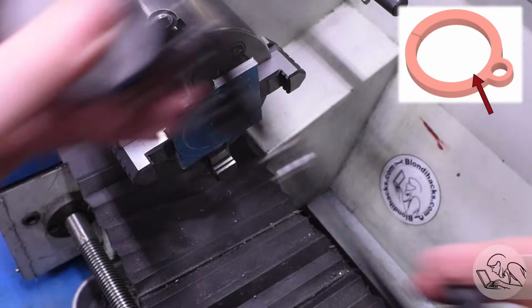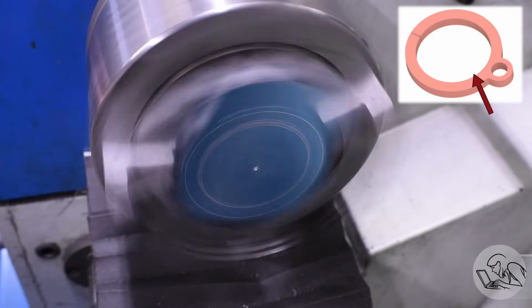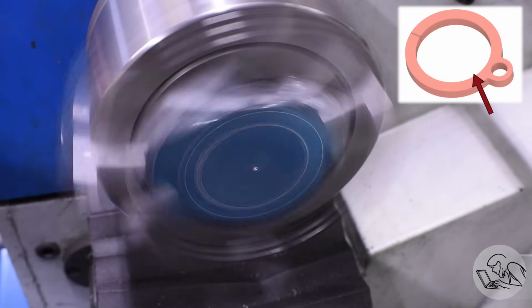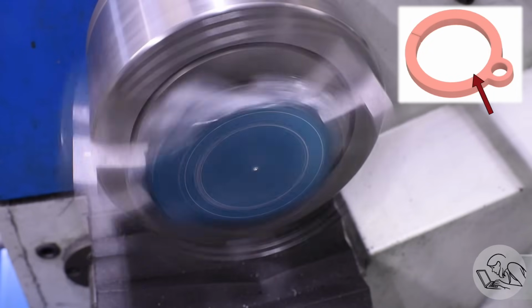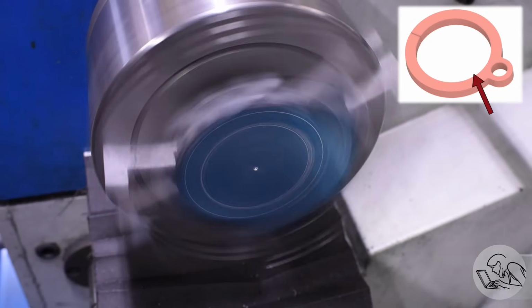You can generally tell how well both of these worked just by spinning it up. Keep your eyes on the punch mark and the scribe lines, not the smudge marks. And you can see that the scribe lines and the punch mark are running very true there, so that worked very well. Now we're ready to make some chips.